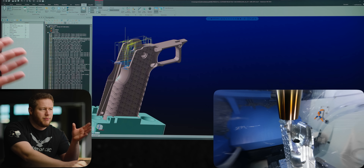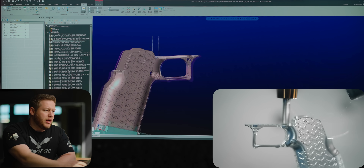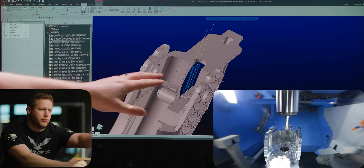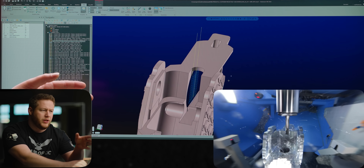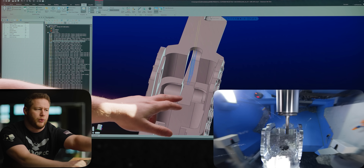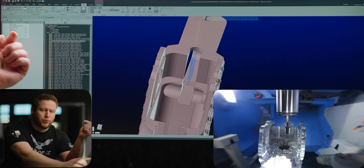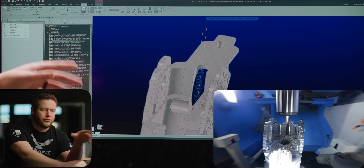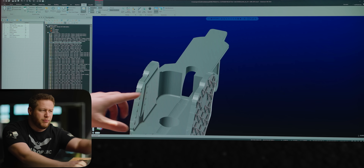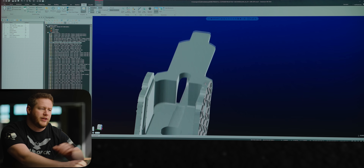Once I've roughed that material away, we're going to come up and semi-finish this floor. After that, I'm going to come in with a smaller tool and rough out where the trigger bow goes — there's a little slot there for the trigger bow. I'm only taking it down to this floor right here, saving the inside where it breaks out for a later time because I want to pre-drill that out first. So what we're going to be left with is this — the bulk of the material taken out and the slot taken care of down to that floor.